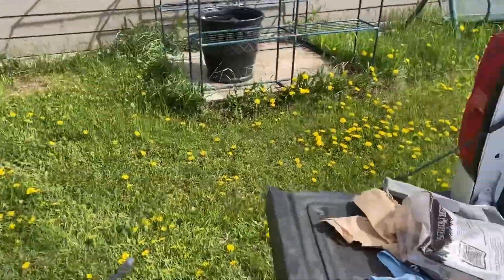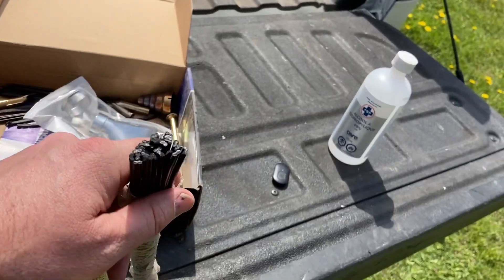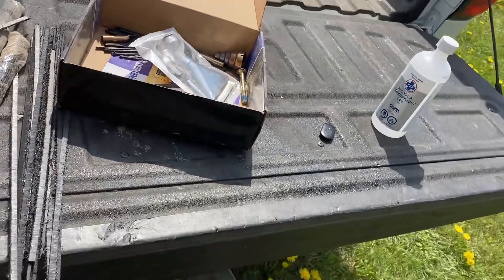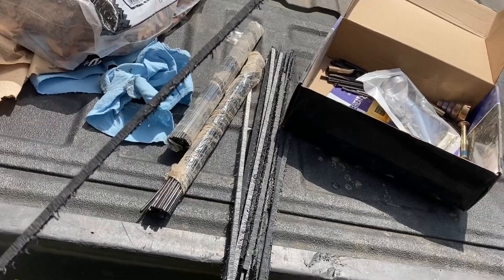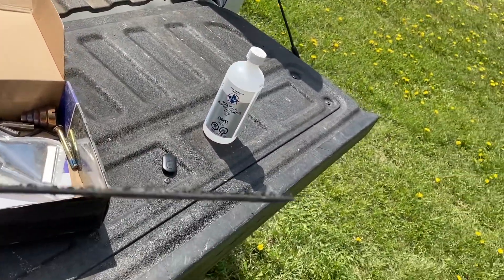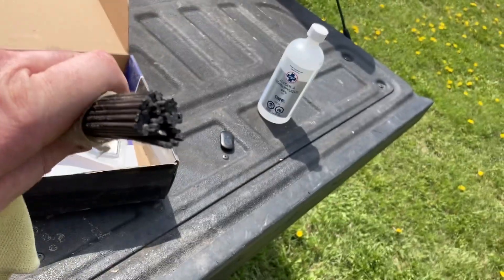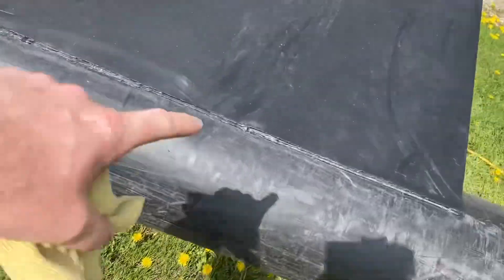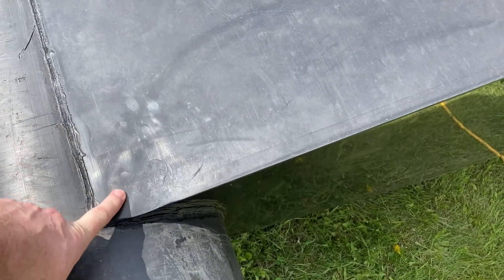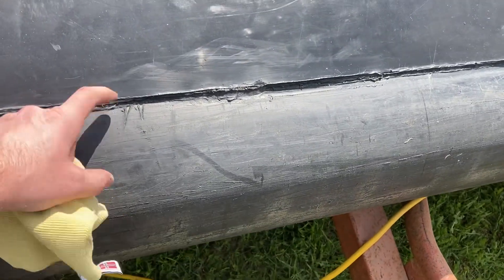The other thing is I've got these rods. I bought these on Amazon — they're not cheap, about 50 for $30. Especially given the amount of welding I'm doing here. What I've done is taken the quarter-inch skin material and cut strips, and these actually work really well for doing the big bead and laying big welds. The smaller rods are really good for the initial stitching because thin material warps tremendously once it gets hot, and smaller rods melt faster and easier. But once you've got a bead stuck together so it can't warp anymore, the big ones fill a lot better.